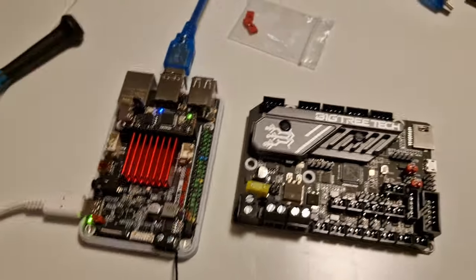Definitely do the updates before moving on — if you don't, it can cause problems. I recommend doing it in two stages: do the system update first (there were 89 packages to upgrade — all the background Linux stuff everything else runs on top of). Then do 'Update All.' During the update, you may lose connection because Moonraker — which sets up the network bridge between Mainsail and your printer — has to shut down during its update. Just hit 'Try Again' and it should reconnect. Once done, everything is updated and good.